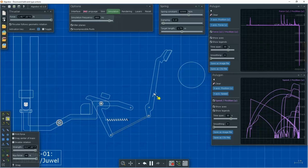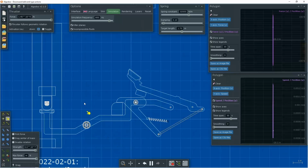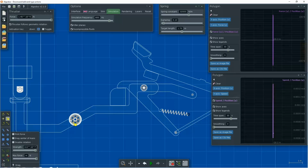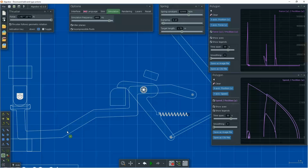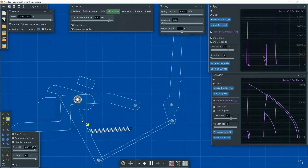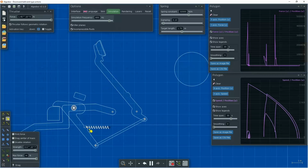Now, theoretically, what this means is that if you press the key especially hard, then the force or impulse applied to this mechanism might be sufficient such that even while, say for example, you let go of the key at this position, then it might stay right here while the type bar, the rest of the type bar, is able to move under its own momentum, independent of the key lever. So theoretically that might help with the speed, or basically your ability to press a key and release it sooner without having to do a full follow-through, and that in turn allows you to type faster.